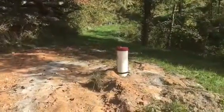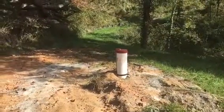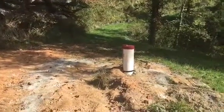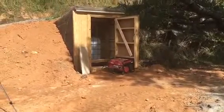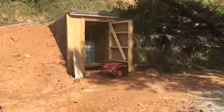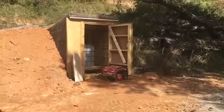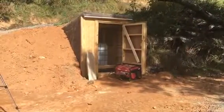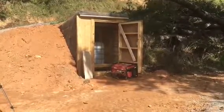So here we are. This is a six-inch well. We're at an elevation of 4,000 feet. This well will probably end up with a 220-volt grid-powered pump, a 24-volt solar pump, and then maybe a mechanical hand pump on top of it. It has a pitless adapter. It runs underground into that pump house. Right now, being they don't have any grid power on the property or solar hooked up yet, it's going to be run by this little generator. It'll fill up that 275-gallon tote, which will give them more than enough water and pressure at 200 feet below this where the camper trailer is set up, while we're building the house and getting the rest of the stuff done. But this is a very simple well system, and it will be used for grid-powered, non-grid-powered, and emergency hand pumping.